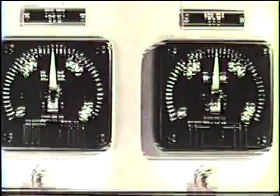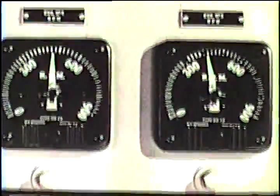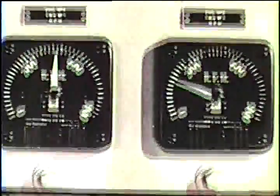If engine number 3 fails and is unable to carry its load, the speed drops. The engine fault relay opens the field circuit of the generator to keep the engine from being driven backward by its generator. The red indicating lamp for number 3 generator lights to show that its field contactors have been opened. When this happens, take the generator out of the propulsion loop.